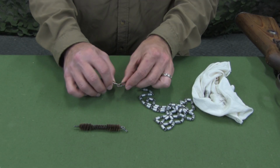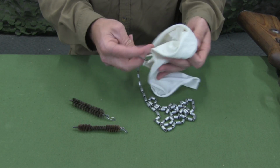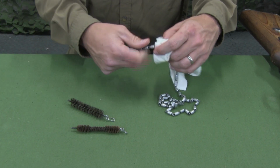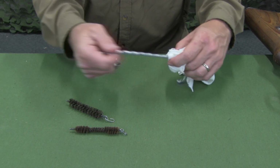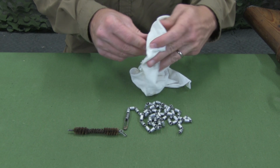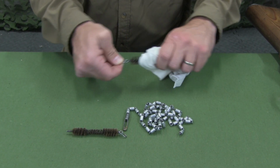The container and the parts of the cleaning kit are always to be kept clean. Any contact of the cleaning chain, brushes, and cleaning wicks with the ground, sand, and the like is to be avoided. After each use, the cleaning chain and brushes are rubbed off with a cleaning cloth or rag. Very dirty cleaning chains can be cleaned by boiling in water without additives.